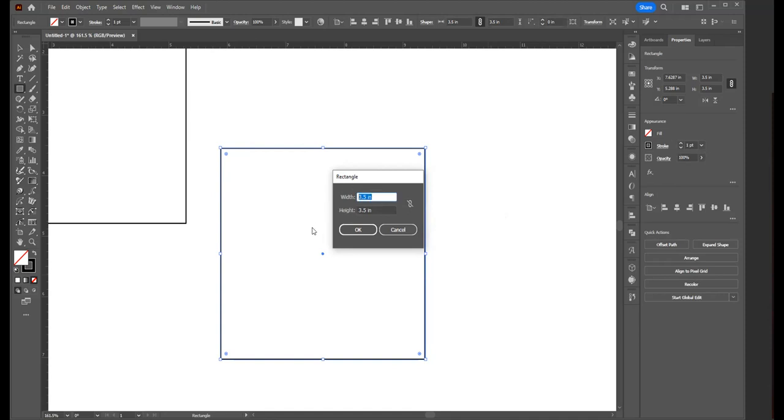First of all, our width is going to be the material width, which is going to be 1/8 inch. So I generally do 0.12 because that's the actual material thickness that you get. You guys want to caliper your material thickness, and then you can work with that. And that way you'll make sure that your boxes, whatever your design is that uses tabs, will always be a nice snug finish. I haven't had to modify anything for the curve on these. I mean, they generally tuck in quite nicely.